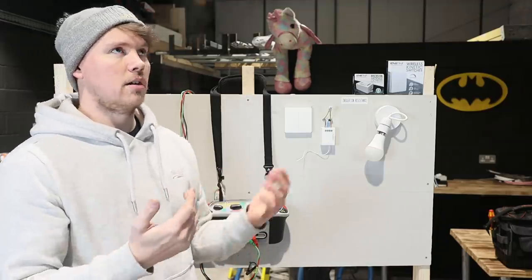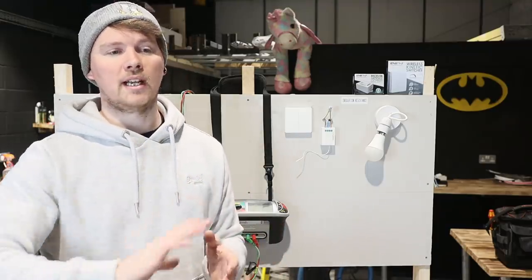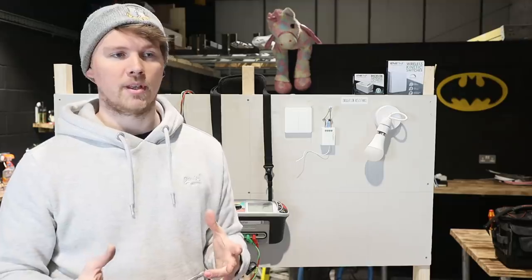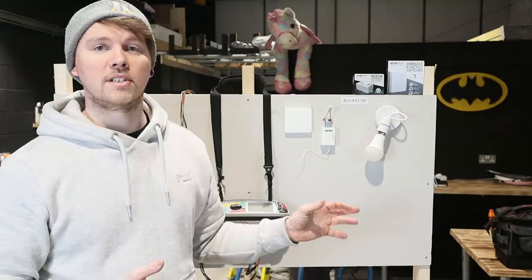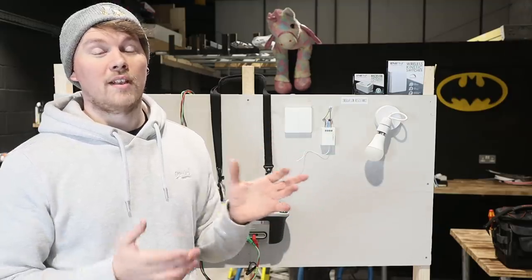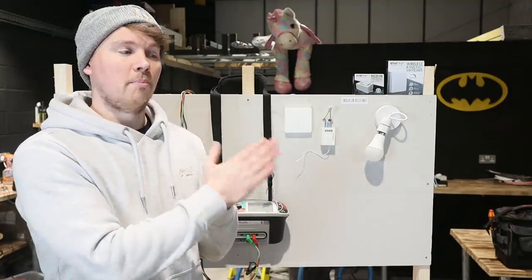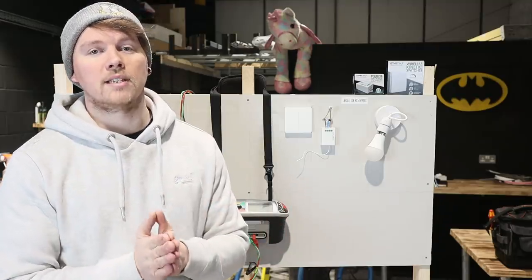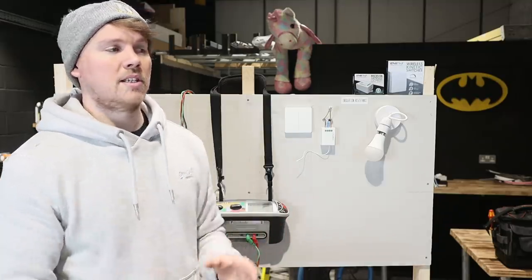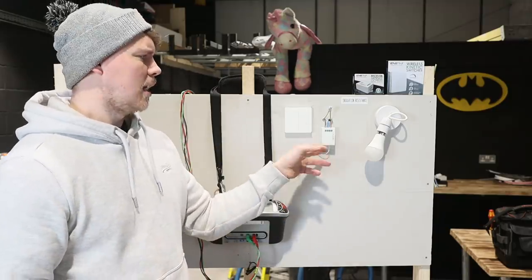The test detects if any cables are wired incorrectly or are in a dead short. Most of the time, if it's clear, our tester reads 999 — not connected at all, a clear path, no conductors connecting to each other. But if you test with a smart switch or a USB double socket, you'll find it reads as connected ever so slightly. However, testing above 240–500 volts would actually damage the appliance — so that's what I'm going to test today.